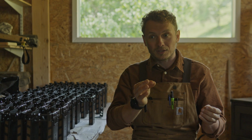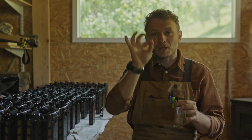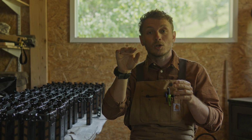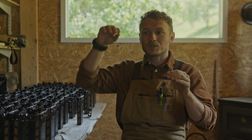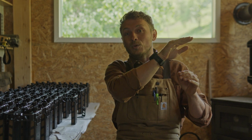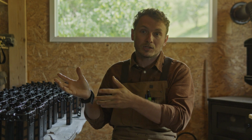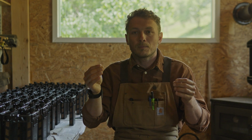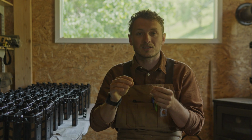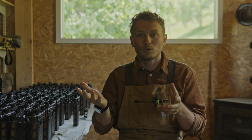The edges were not smooth. There was bleed over from the laser, where the laser penetrates the aluminum. This is going to go a bit more into the technical details for all the engineers out there, but essentially the cut-in parameters, where the laser cuts through and enters the actual pathway of the cutting, were set wrong by the operator, or maybe the aluminum that they used in the actual production was different. I don't know actually what happened, but these parts needed much more handwork, like maintenance, cleaning by hand, these little tiny specks on the actual aluminum.